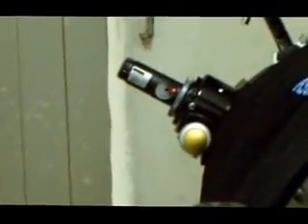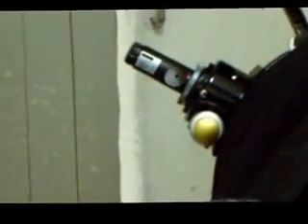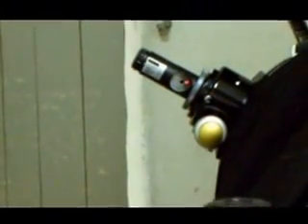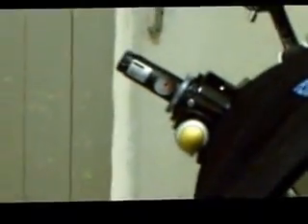Before you start, make sure the small locking screws are loose. Now we're going to adjust each bolt and try to get that dot to disappear. I'm moving that mirror — I've gone two forward so I go back on myself. As you can see, the dot is now moving towards the hole. That's looking very close — just another screw.